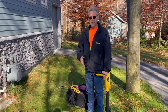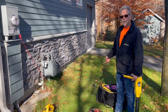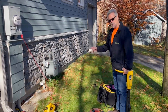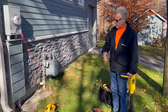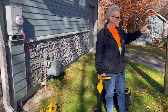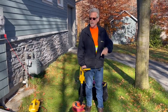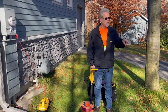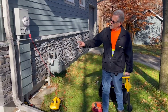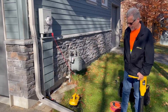So let's talk about what we can do to change this. We lit up one line but found two signals, and probably the reason is we put our ground stake over close to this gas line without thinking much about that. What I'm going to do is move my ground stake to one side or the other — I want to get my ground return point away from what we believe is a second line. My choice would be to put my ground stake way out there somewhere, but if there's a second line here and I put my ground stake there, my signal will go out on one line and come back on that still because it's trying to get to the return point.